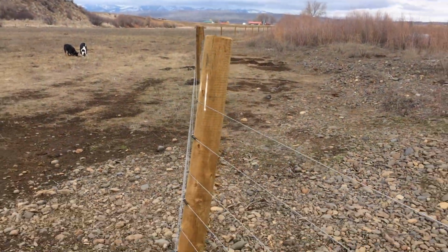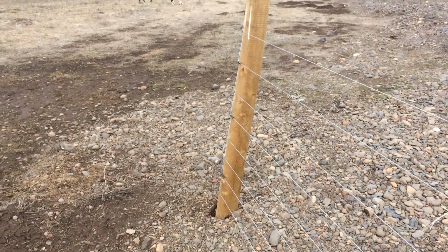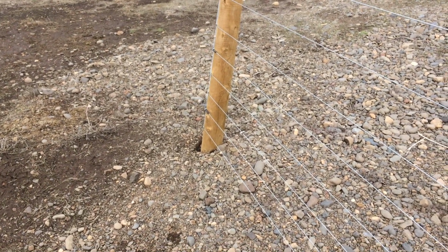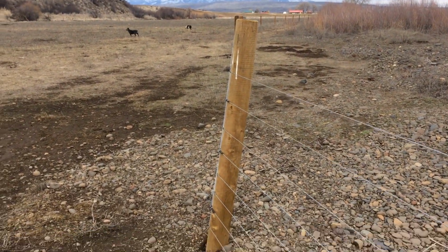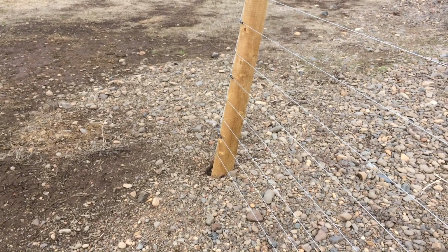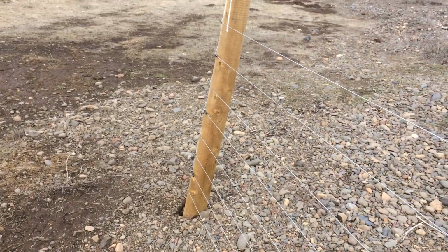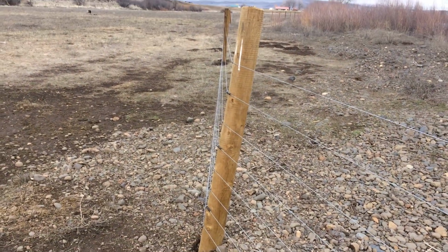This was standing in water, and this ground is a lot of gravel and pebbles and sand. Super hard to put posts in, but it looks to me, you know how when you run water through sand it almost becomes quicksand? I think that's basically what happened here. As soon as there was water moving around on it, the ground just becomes flowable, and I think this just bent over. So this is an area we'll probably have to do 2 more posts and an H-frame on either side of this corner, and we'll have to reinstall that corner post.